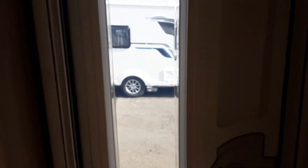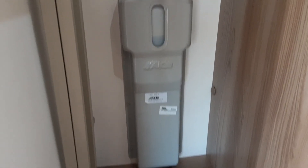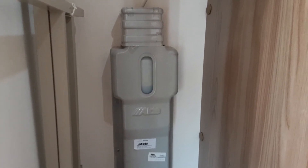You don't need to do anything with the heating tank which is in the cupboard here — you leave that alone and don't drain it off at all. It's essentially like the header tank on your car where you put in your coolant.